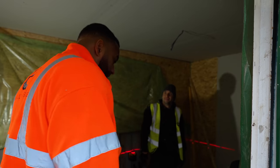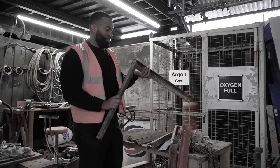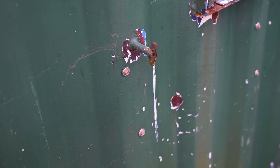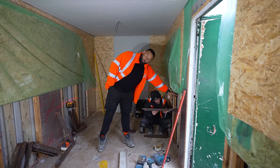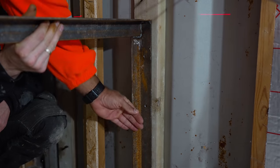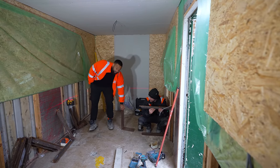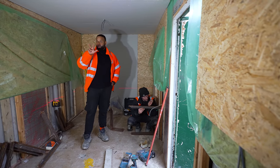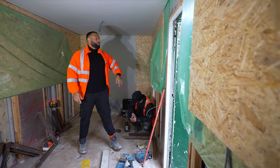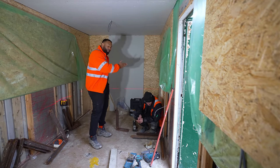We're going to put timber and then attach to the timber. These supports that we made a long time ago — we're about to fix these onto the wall. We've taken a piece of 4x2 and used timber locks, bolted it to the container, and then bolting the support to the 4x2 with timber locks again. That should keep it in place. By the time we build the wall up, all you're going to see is this bit, and it should be nice and secure. We're using the big ones at the front and the smaller ones at the back of each desk. The desk should end up being 500 by 700 — we've got four there, two here and one teacher's desk. On the top level we have the insulation in already, the membrane and the board build-up. We're going to wait till we've done all of this round here and then fit the insulation in between the gaps as well.